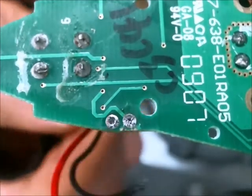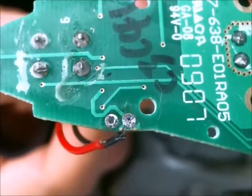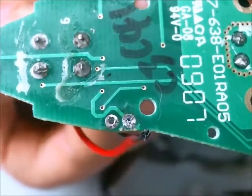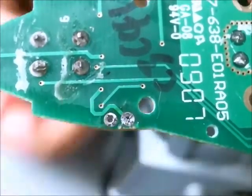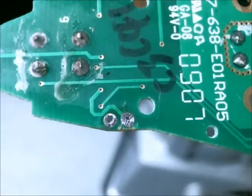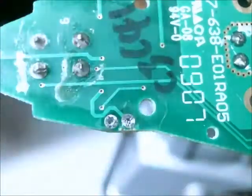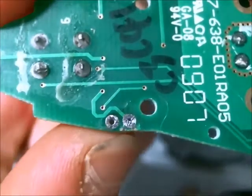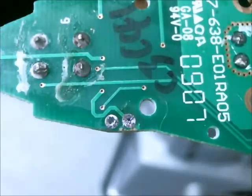I've run into a problem. I had two wires connected to these two points here and they broke off. These wires are stranded, so little pieces of the stranded conductor ended up inside this hole here. I've tried desoldering it using a solder sucker or a solder vacuum and it didn't work out too well. So what I'm going to have to do is get a solid conductor, heat up this hole, and try pushing out the stranded conductors.